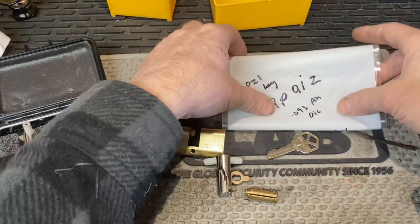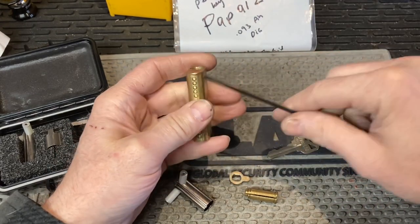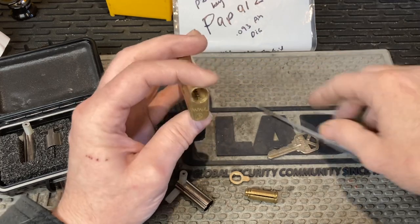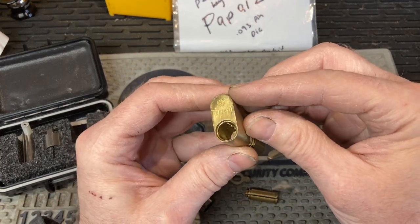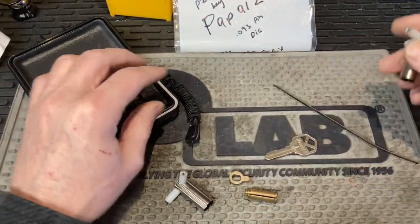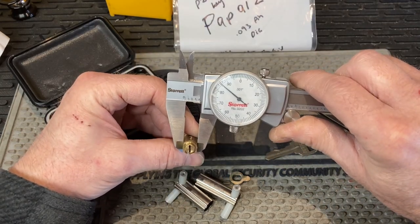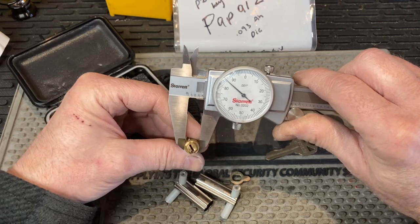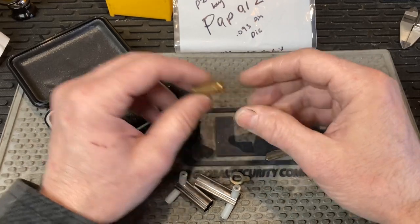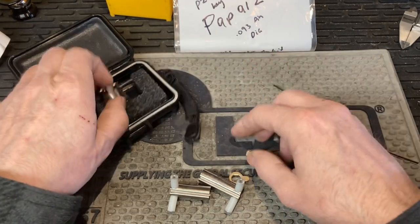I thought I'd go ahead and try to put this together. You know, if you want to drill these out and find a way to hammer them back in, I've heard people using master wafers from a standard pin kit to fit into these — there's different ways. You can drill and tap it. There's still a spring captured in there I couldn't get out. They are a different pin diameter — not the same as your standards. Your standard is around a 490; this is a 385-386 plug diameter. Half inch is usually around what most common cylinder plug diameters are — 375 and up. So this one, yeah, I couldn't do it.